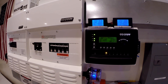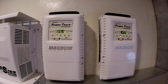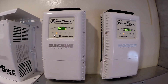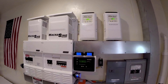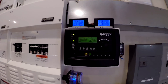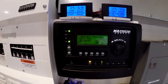The dryer element has kicked off. It just kicked back on — that was the sun. Look at that — over 100 amps. Close to 4 o'clock and we're still pulling 105 amps at 53 volts. That's a lot of power. We're just charging the batteries up now.